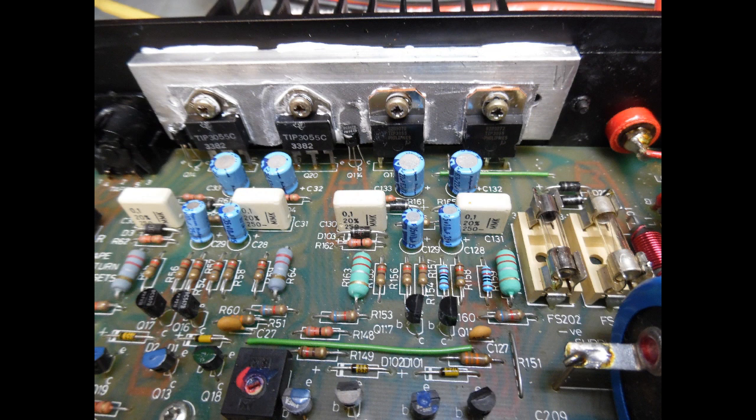This typically indicates excess current draw. There are also two blown fuses. Inside this amp there are a total of four fuses — two power supply fuses rated as quick blow at 3.15 amps, and for the speaker protection outputs, quick blow fuses rated at 1.6 amps. The right channel fuse had blown, as had one of the power supply protection fuses. There's also a small-signal BFR-series transistor in the driver stage of the right channel which had blown completely off the circuit board.